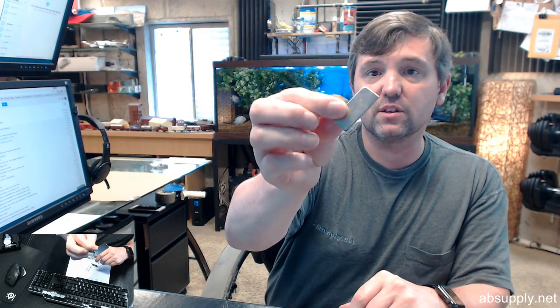Screw locks, hinge to glass. I guess they're referring to this and the 2 set screws. Requires the use of a latch to hold the door closed. Sure, a magnetic touch latch, something of that nature. Glass thickness 1/8 to 3/16. Face plate size 3/4 by 1.5 inch. We've given that dimension. Angle of opening 140 degree.